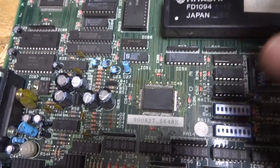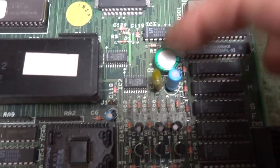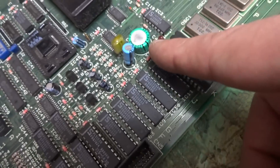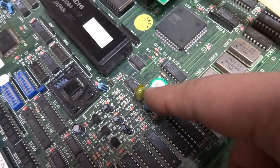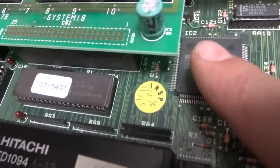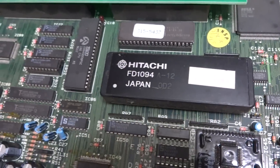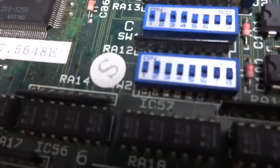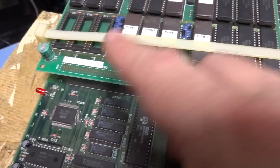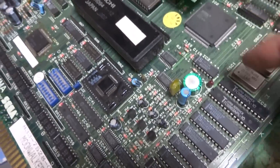What we're going to have to do is take the chips off and replace these capacitors. There's a super capacitor down here — I'd really like to get another one for that, I believe I have one. I'm going to have to find some 16-volt 470-microfarad capacitors. I'm going to need at least five of these; the other ones look semi-okay.